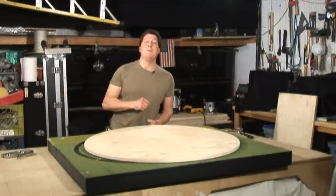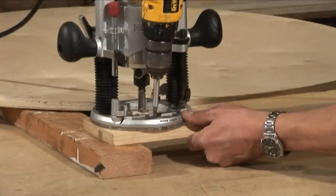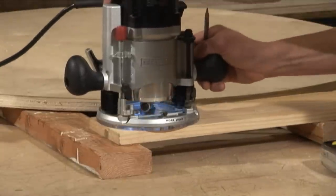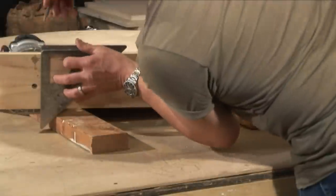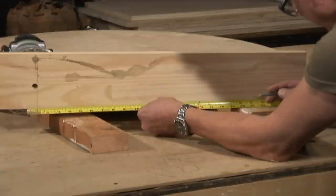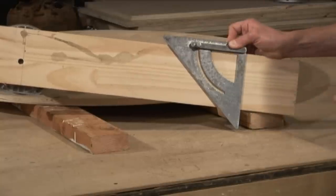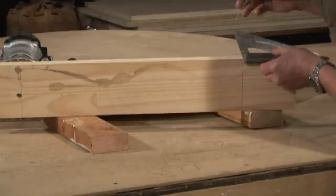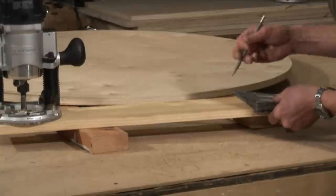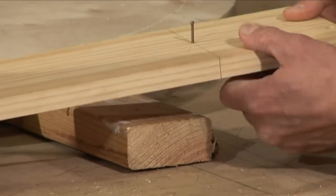Come join us and we'll show you how we do it. First, center and attach your plunge router to your piece of scrap wood, go ahead and make your hole. Then turn your piece on its side and make a mark at the edge of the hole, measure over 20 inches and make a mark. Square it up, then transfer that mark to the side and then to the top. Make a center mark on that line and with the wood hammer in an eight-penny finish nail — doesn't have to stick out too far, maybe a quarter of an inch.